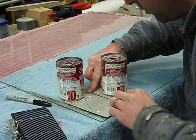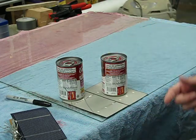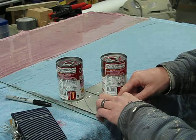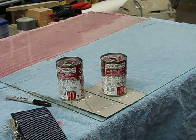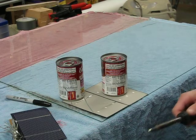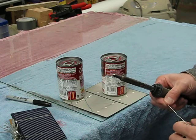When you're figuring out how many you need for a 12 volt panel, you actually make a lot more than 12 volts. I run 36 of these into one panel — open voltage ends up being above 20 volts. That gives you enough power to charge a 12 volt battery once you put the load on.